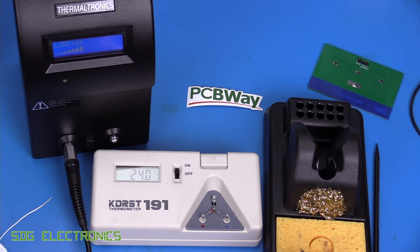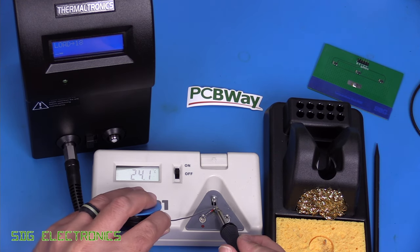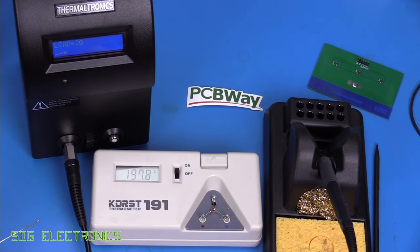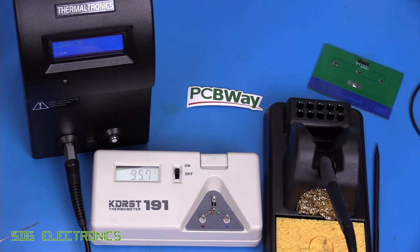Let's see what temperature it idles at. It is taking quite a long time to heat up — probably about six or seven seconds. The temperature settles at 386°C. Adding a bit more solder, we see a drop and then it climbs back up to 386-387°C. So it's quite a hot cartridge — probably fine for lead-free, a little on the warm side for lead. That means in the soldering tests it might have an easier job, being able to dump a bit more power in.